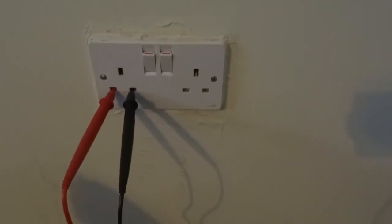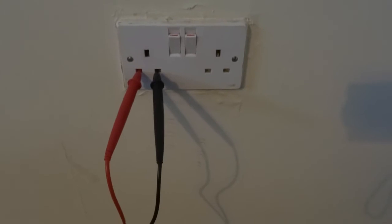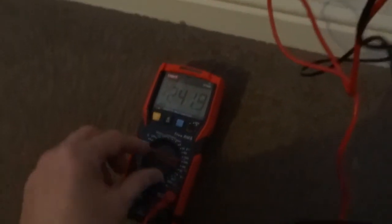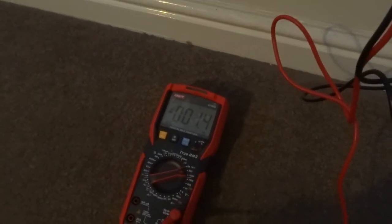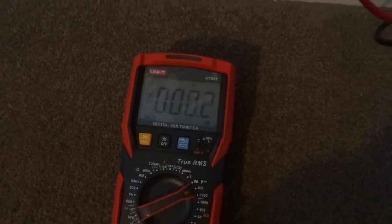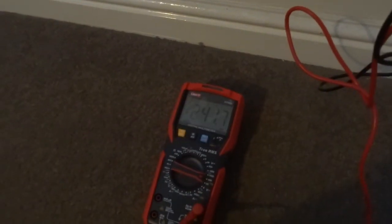These are the main dangers you face. As you can see, 240 volts — it's live, it's proving that it's live, so it's unsafe to work. But if you've selected the wrong setting — so you're on volts DC — the voltage now looks like it's nothing. So that is very, very dangerous. Always make sure you're on the right setting.